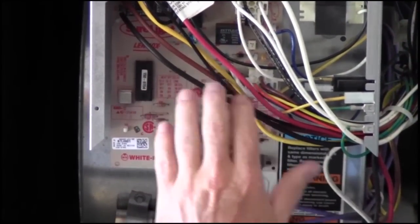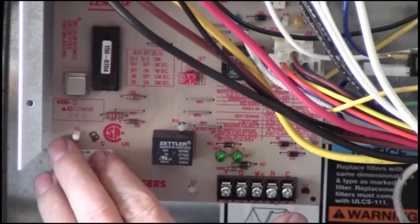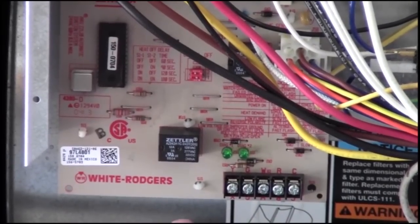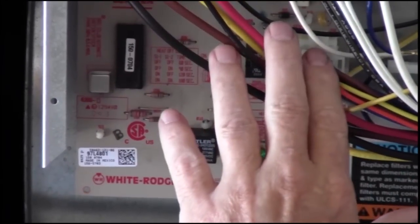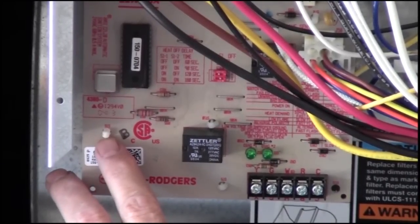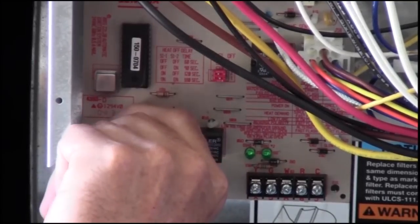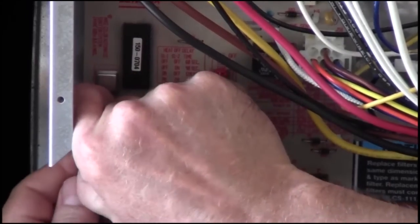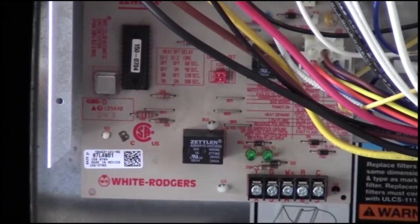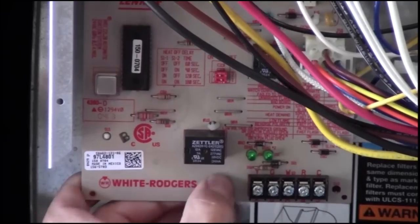When removing the board, we're not going to take off any of the wires before I remove the board. I'm going to go ahead and remove it, pull the board aside, mount the new control, and then I'll start pulling wires off the old control and putting them on the new control. You'll see over the board we have these little connectors that connect the board. You just need to pinch them together and then pull out — the board starts to come off. Sometimes you may need a little pair of needle nose pliers to get that to happen.